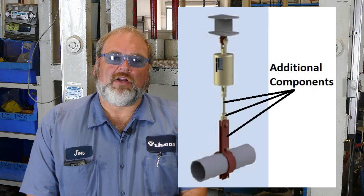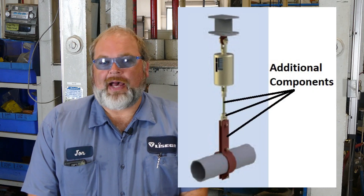As the pipe moves up or down due to thermal movement, the spring coil will relax or compress accordingly, and the support will apply more or less load to the piping system as it travels through its range of movement. Under normal circumstances, the spring has been calibrated here at our facility to the preset load.